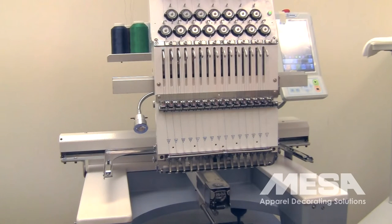If the issue is all needles are sewing poorly or not picking up after color changes or trims, then the issue is very unlikely to be needle depth. Needle depth would be something that would need to be checked or adjusted after striking a hoop, having a bird nest, or some other kind of malfunction of the machine — and then following clearing that malfunction, that needle not sewing correctly, whereas all the rest of the needles still do.